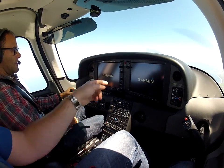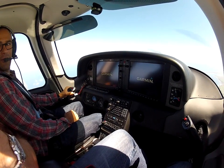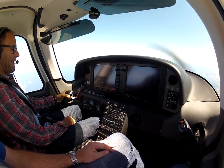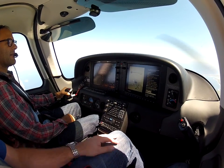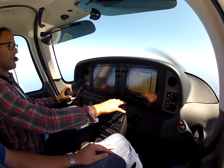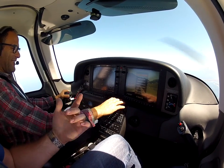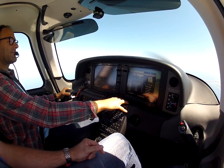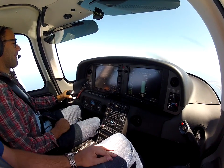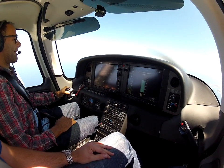So another question for you — will our avionics actually reset in flight? It should, yeah. The nice thing about the Garmin is it will reset in flight. The Avidyne system usually wouldn't — it was kind of a fluke thing. But this will actually reset in flight, which makes it really nice. I've never done that before. Yeah, most people haven't. We always read in the book that you can run without the switches, but nobody actually switches them off. So it's really good to know what your airplane is capable of. If you get in that situation, you want to feel comfortable getting rid of the electrical and just flying the airplane.